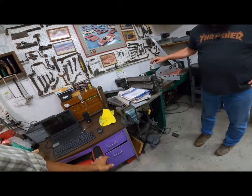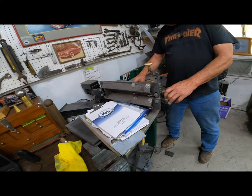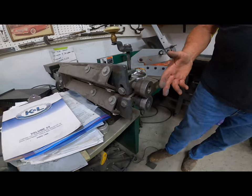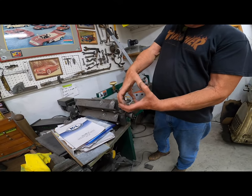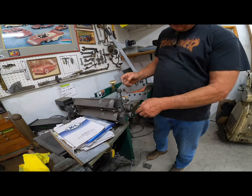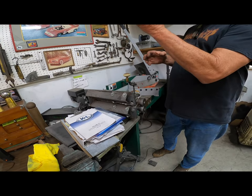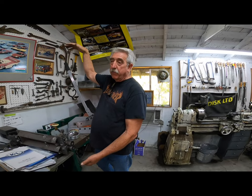This is a Harbor Freight bead roller, but it is highly modified. We made the sleeves stretch in and out with a set screw and added an Eastwood variable speed control. We started this business actually repairing vacuum advances with the crimped-together clamshell. I have a tool we invented to open them up, but once they're open they're like a bottle cap, so you can put them in here, run them, and it makes them new again. We have done two-inch circles cut from four-by-eight sheets of laminated material to build vacuum diaphragms.